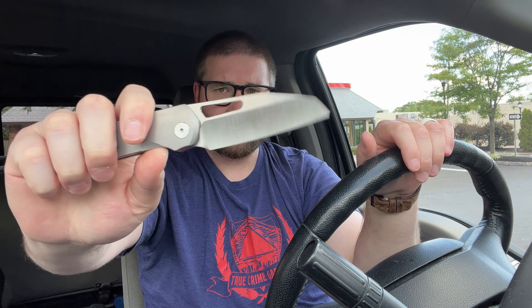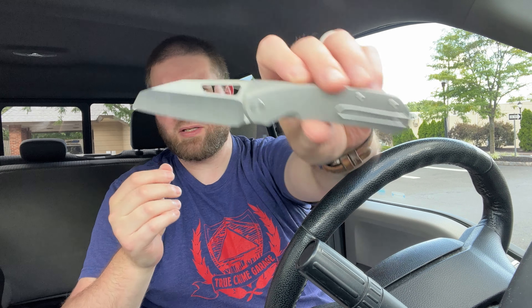The clip needs to be updated to take Lynch replacement clips and Rips Garage Tech clips — right now it's a little too wide. On the hardware side, the clip screws are T6 because they didn't have T8 clip screws, and the pivot is T8 because they didn't have T10. So we're either going to do T10 and make sure everything else is T8, or we'll just do all T8. The screws for the insert are T6 — I'll find out if we can do that in T8, but it might just be a necessity. We do plan to provide an extra insert with the knife.